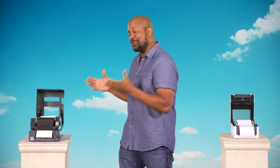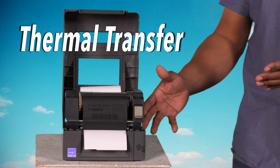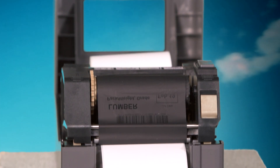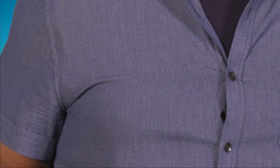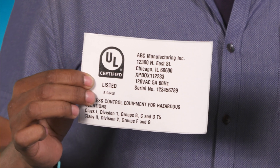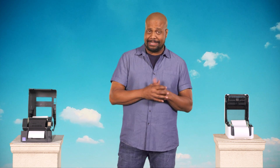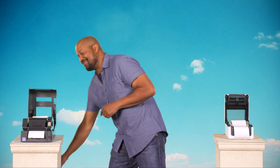Long-term needs goes to thermal transfer. Thermal transfer uses a ribbon process to melt the ink, so the image becomes part of the paper or label, resulting in a more durable, long-lasting image. There are more components to the setup, which results in additional expenses and maintenance. You can also print in color through the ribbons.